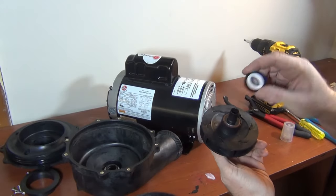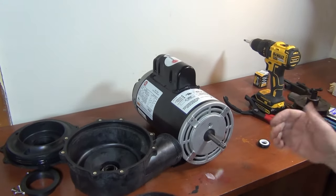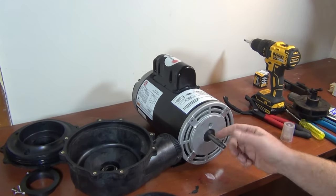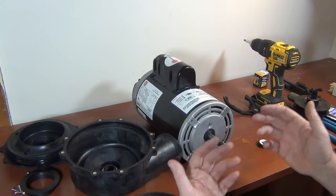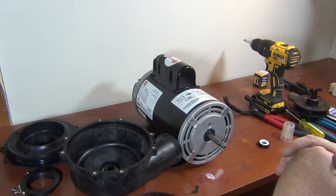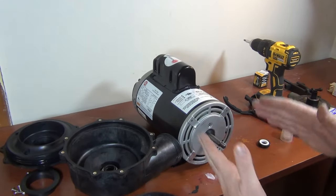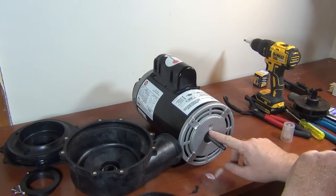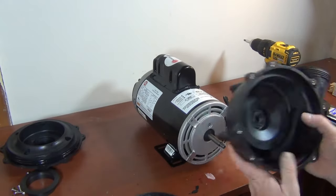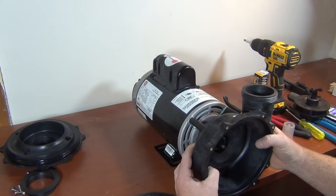Get your new impeller if you need one, or just change the seal, and put it back in. When putting it all back together, make sure everything is cleaned off. I use gasket grease — a water-repellent grease for pools and spas. I'll link that in the description. Goop it in there generously, especially if the pump is a bit warped. If you don't remember how everything goes back, use your pictures.